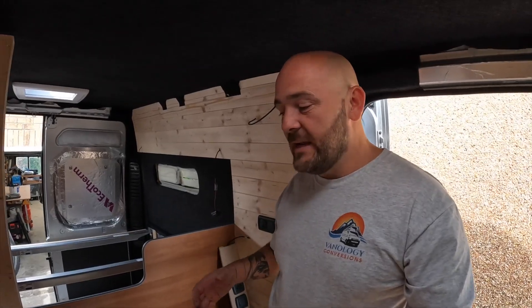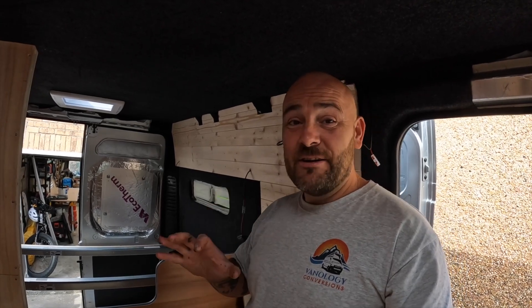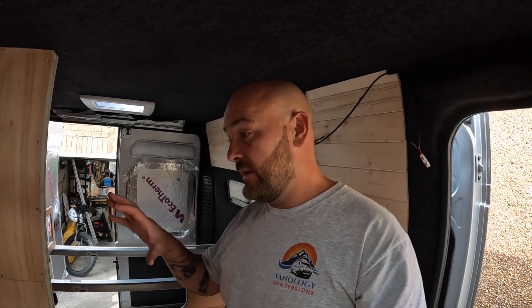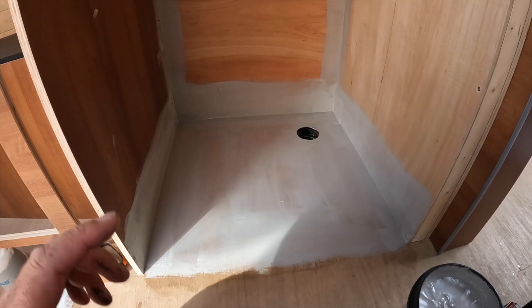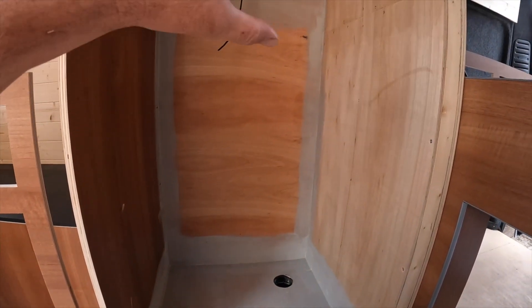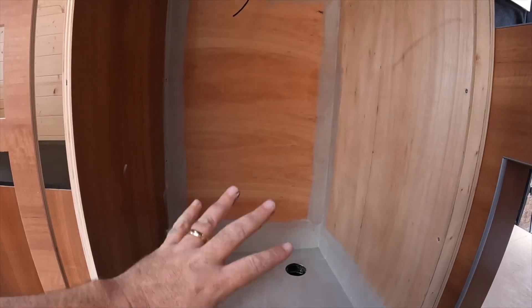Tanking is used in wet rooms - it's a waterproofing sealant system that needs to be done on any camper van. I can guarantee any camper van built without a tanking kit is either leaking and you don't know about it, has leaked, or is going to leak very soon. When tanking, you need to do a primer over all the internal walls and floor of the shower. I buy a kit from Screwfix - I think it's called a Mapei shower waterproofing kit - which comes with an SBR primer. You go around, prime it all, and leave it to soak in for about an hour until nice and dry.